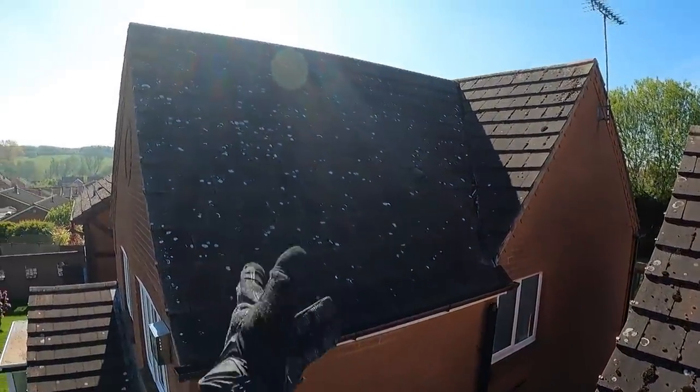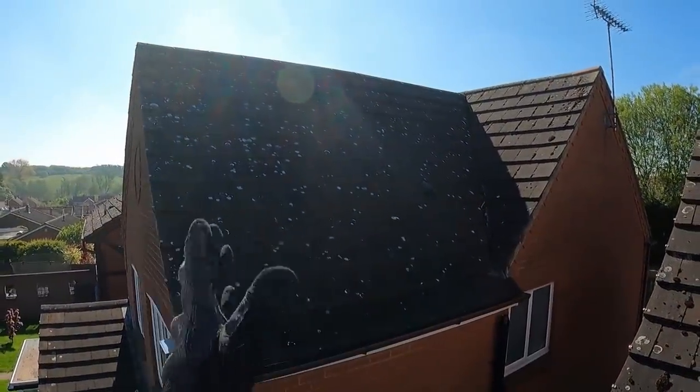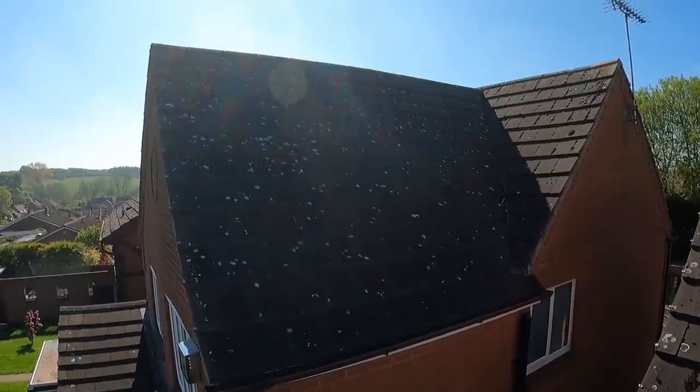The way I choose to do a roof is to just remove the moss, apply the chemical, and let the chemical do the work. Using licensed products, the green and the yellow colouring will go quite quickly, within a few weeks, so that's basically the reason why. So I thought I'd clear that up for everyone wondering, because I know in America there's not much moss that grows on the roofs there, so it's a case of just putting some bleach on the roof, downstreaming it, and it will come up, you know, transform within the day.